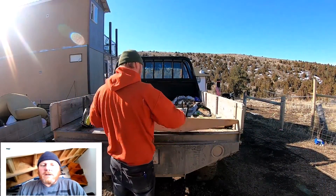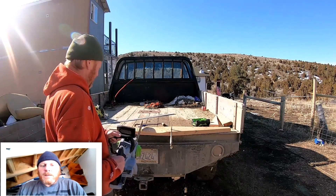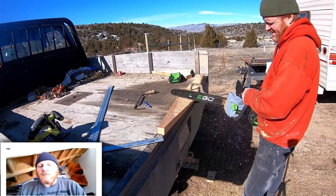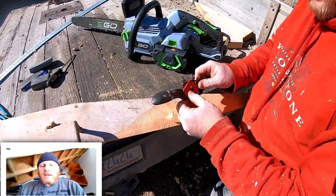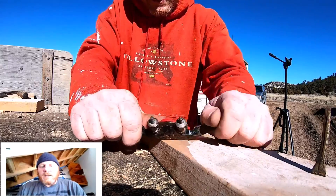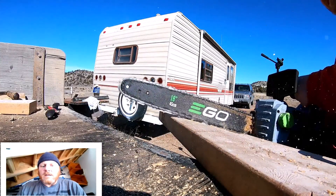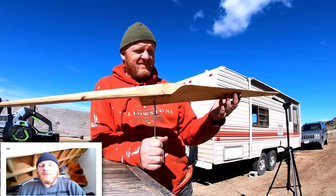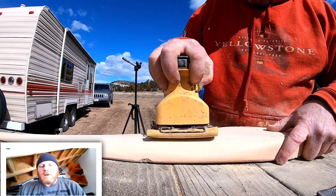I got a comment in one of my videos from a guy who had some issues with cogging in an older design I showed. He had used too-large magnets and had serious cogging issues. So I'm making a very wide blade here to show how to overcome those cogging issues — the wider the blade, the more wind it catches, and when it comes to startup torque, getting it going is the hard part, especially with alternators that cog badly.